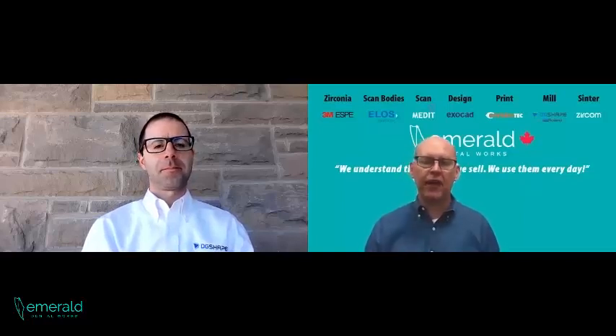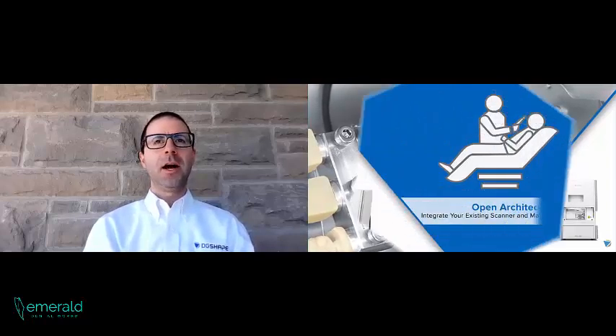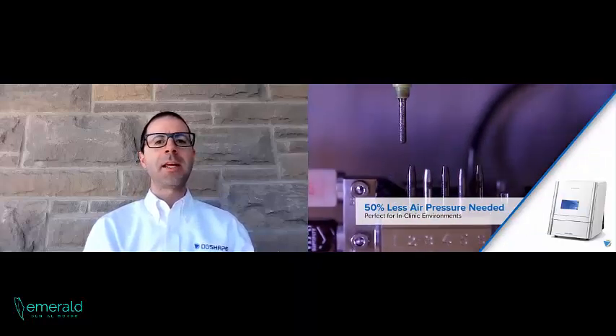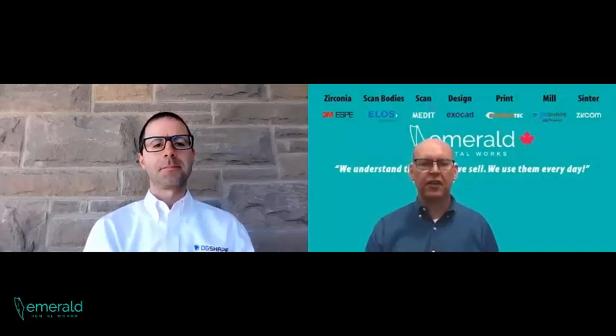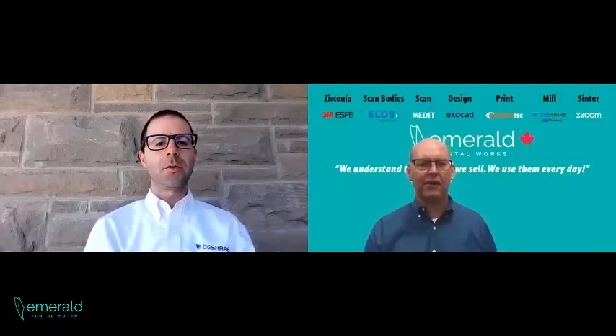What's the air pressure you have to have for those wet mills? Everybody says Roland's air pressure is too high — what's that number? With the 42W, it's 44 PSI, which is not very high at all. A dental compressor is at 80 PSI minimum, so there's no need for a dedicated compressor. You would simply tee off another line and run it right to the mill. You always want clean, dry air going into the equipment — you don't want any contamination inside the milling chamber.